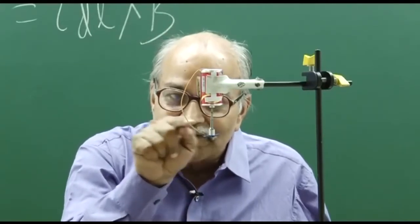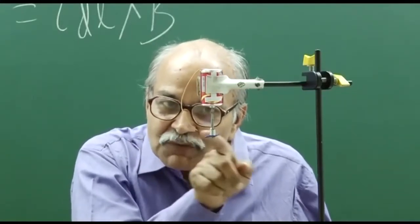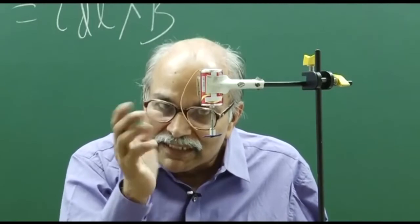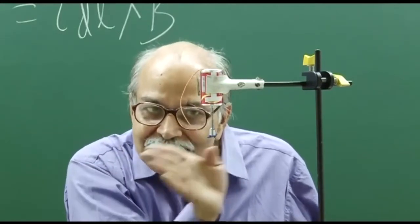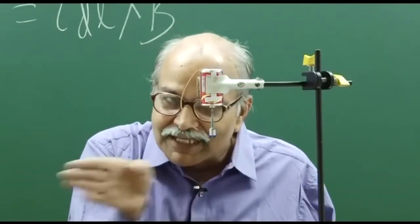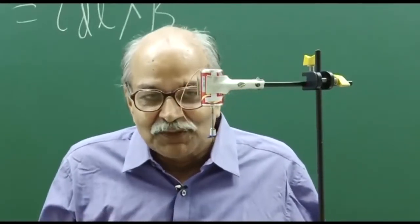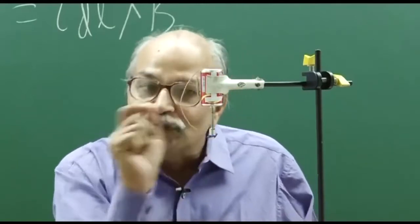It has to enter that flat space, and then from there it has to go down, and then it has to come towards the surface and reach this wire here. So that component of current, although current is a scalar quantity, still has some component in this axial direction to reach the surface. It enters from top and it has to reach the surface, so it has to go in axial direction. That defines dl. That is the part of the current which is taking part in this whole experiment. So your dl is inside the magnet from the inner regions to the surface regions.